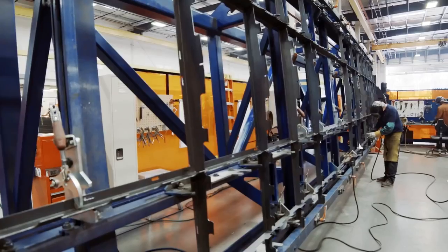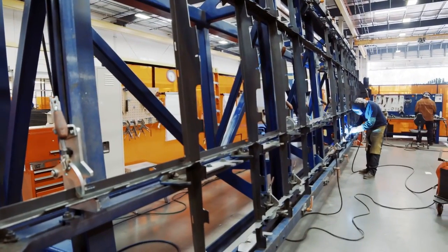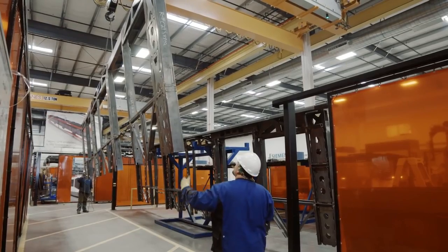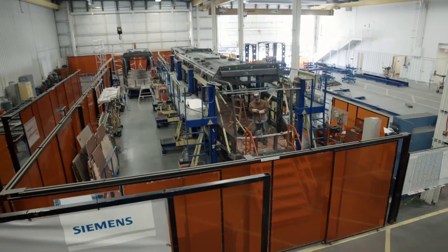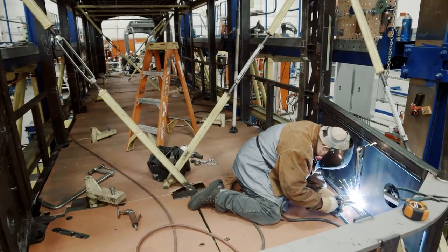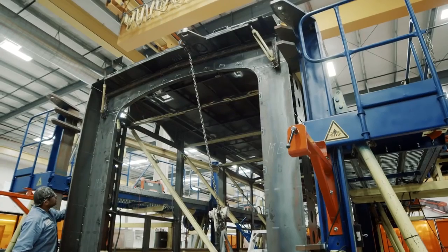In parallel to that, we have a roof station going on, where we put in the ribs and then the roof skin. When all those piece parts are now ready to integrate, we put them into our integration fixture — the integration fixture is where we put the under frame in with the sidewalls and with the roof.